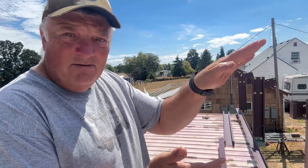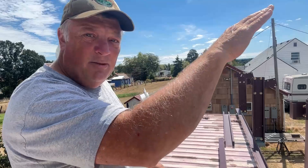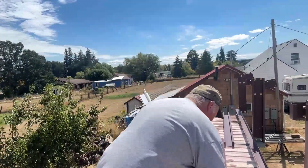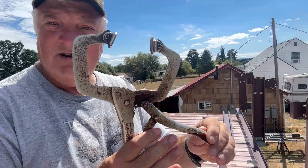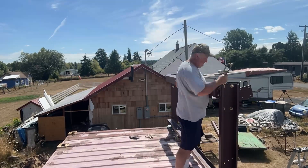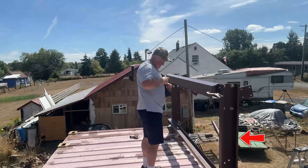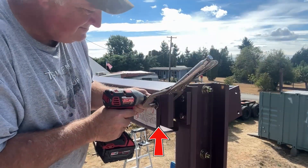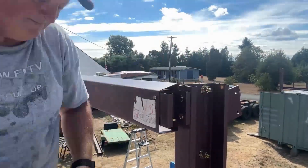It's not exactly clear how it is supposed to go up onto these, but I am going to assume that the beveled edge — the edge that isn't quite square — is going to be facing up or at least going toward the center, toward the peak of the roof. Sorry about all the shaking, because this thing is just sitting there on the connex with me. What I'm going to use are these clamps to help hold them together so I can do this as a one-person job — it's DIY, right? When you do this, make sure that you use a level so the girt columns are going up level. Generally speaking, you're going to want to have that intermediate girt column — the eave purlin — attached to the center of that C bracket, but you will have some adjustability. The main part is to keep things level.